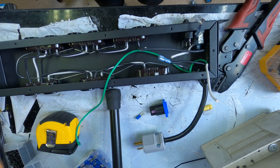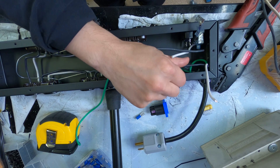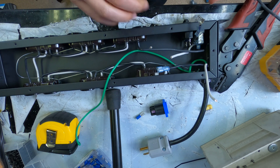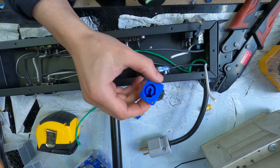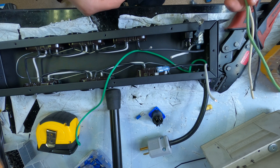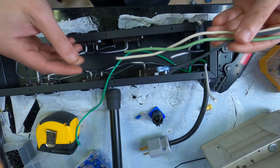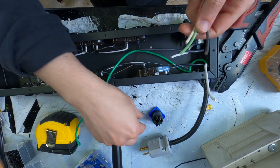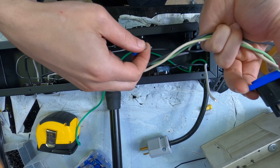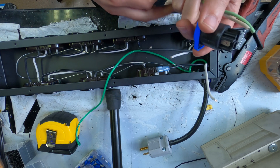I disconnected my neutrals because this is going to be a lot easier to wire. This is a little short and won't reach the other outlet, so I need to tap from my hot line — I'll either use a Wago or a butt splice. The first thing I want to do is get my supply in. These PowerCons have L for hot, N for neutral, and obviously a ground. The internal wiring is using 14-gauge wire, so I took a piece of scrap and cut the exterior jacketing off — so much easier to use than hardwire. I'm going to use a female disconnect, crimp these on, and mount it with super long tails then trim them.